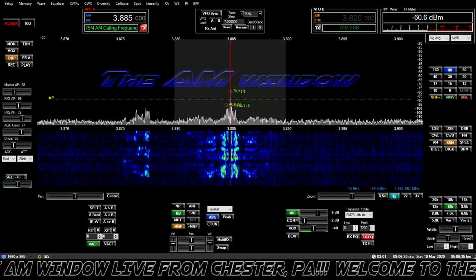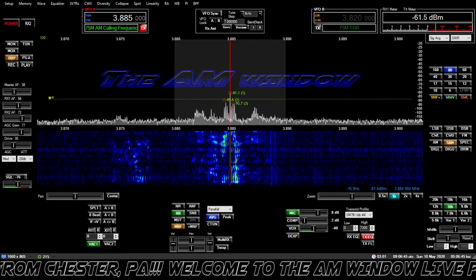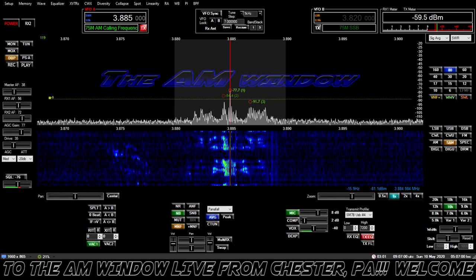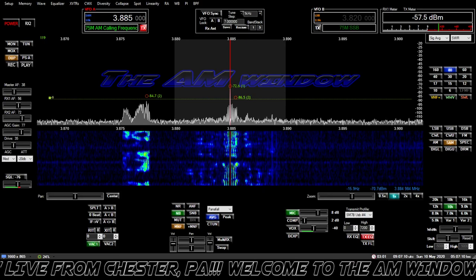But about the only other antenna work I'm getting ready to do down here: I bolted one of the, it's called a Dominator 6. It's a 6-meter vertical five-eighths wave, a commercial antenna made for the amateur band, and it's for 6 meters. And I've been itching to get the 6-meter band up and running pretty good around here.